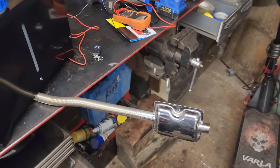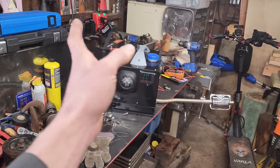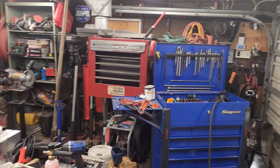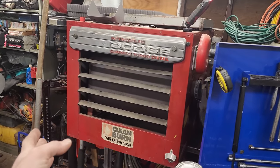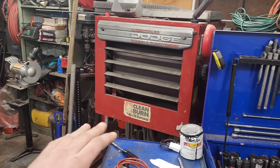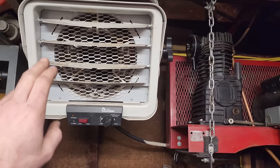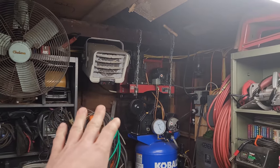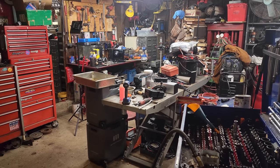This is a great little hand warmer if you're wrenching outside. I'm gonna let this go to town in here with no ventilation - I do have a carbon monoxide detector in here. This is kind of a two-car garage, not really insulated at all and super drafty. I usually heat this with the waste oil furnace, a Clean Burn CB2000 - it's a 200,000 BTU thing, works awesome, but it's actually down right now. I've been running an 8,000 watt electric heater just to keep it above freezing at night. It's currently 45 degrees in the garage and 38 outside - I'm gonna shut this door and check back in a little bit.